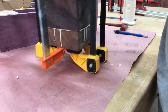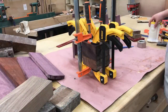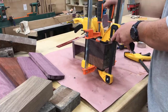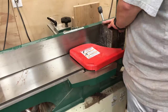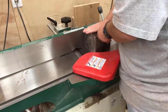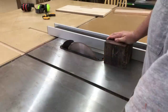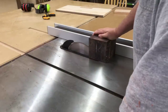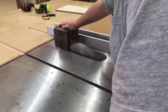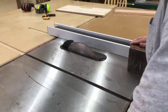I did, of course, clean the surfaces with acetone before I glued them up. I let it dry overnight and now we'll take the clamps off — as you can see, there is no such thing as too many clamps. Now I'm going to joint that block square on a couple of sides and then cut it to width on the table saw. Many of the cuts that I make on the table saw I do so because I'm completely comfortable with it. I have never cut myself and I have been woodworking for 32 years. If there's a cut that you feel uncomfortable with, don't do it, or find a different way that makes you comfortable.